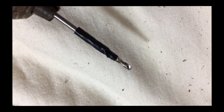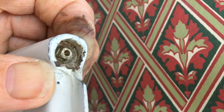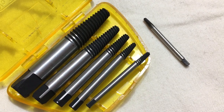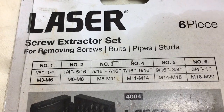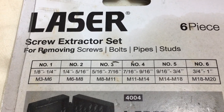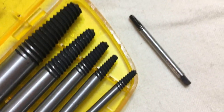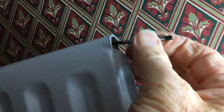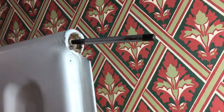What we've got here is a screw extractor set which comes from Laser — you can get that at Halfords and places like that. I'm thinking the very smallest setting, the eighth one down on the right, may be able to encourage it to go in that hole there, and if we're clever we may be able to twist that out of there.